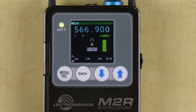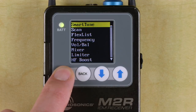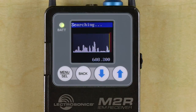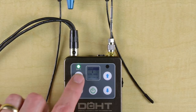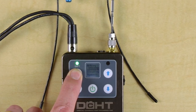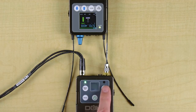There's a lot going on inside this transmitter, but let me show you how easy it is to get it set up and running with the M2R digital receiver. Usually, you want your receiver to choose a clean frequency by scanning or using SmartTune. We'll use SmartTune on the M2R, which takes about 30 seconds to scan from 470 to 608 MHz before choosing the cleanest frequency. Once that's done, we'll go to the M2R menu in the DCHT to sync up the transmitter. After selecting Get Freq, we see Sync and an arrow pointing to the Up button. Hold the units close with the IR windows facing each other and press the button — you'll see the handshake on both units, and just like that, they're synced.